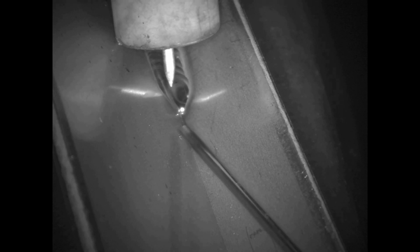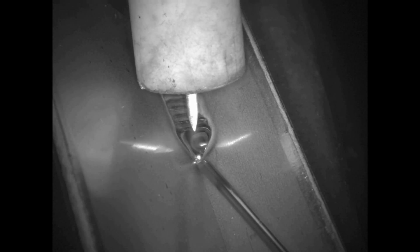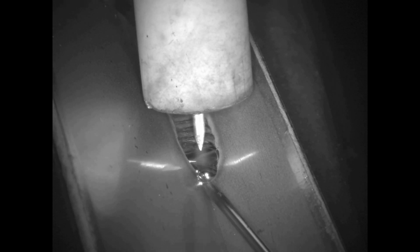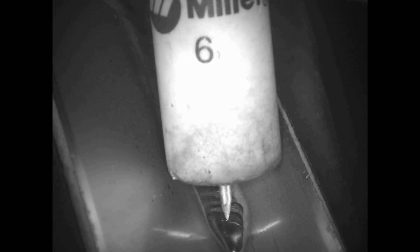We've got the arc initiated here — you can see it's getting wet on one side, wet on the other. Dab. Then I surge the pedal down to get it to fuse on both sides, and then we just start running across. I'm dabbing as it needs. It takes off whatever it wants from the wire — you don't have to jam right in there. You want to stay on the leading edge and just let the weld kind of suck what it wants off the wire.